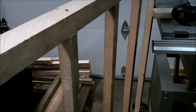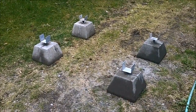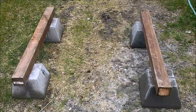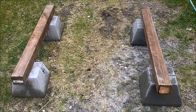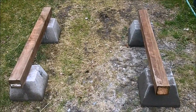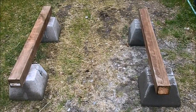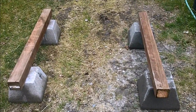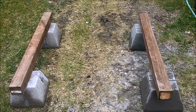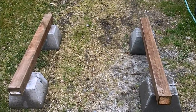I'm going to start building the floor by putting the pier blocks down first, just in a rough dimension — they're going to be four feet apart lengthwise and three feet deep. I decided to take the saddles out of the pier blocks because I'm going to build the floor first and then move it into its final location. I just need a work area that illustrates the dimensions, so I'll get these 4x4s true and plumb to each other and then put the 2x3 framework I've already built on top, get them squared up, and then toenail them together.